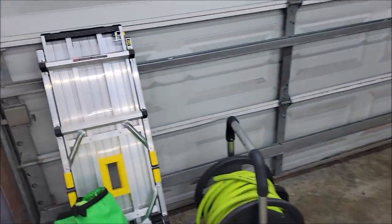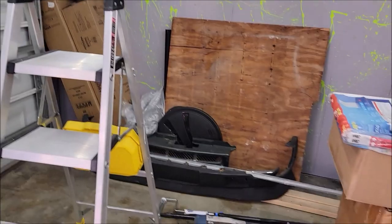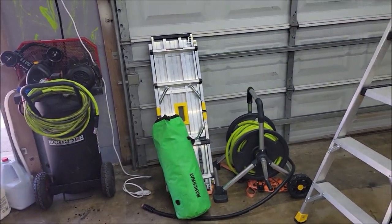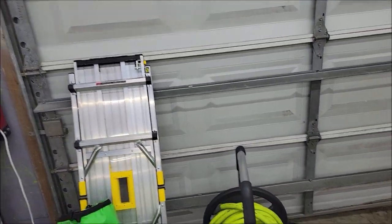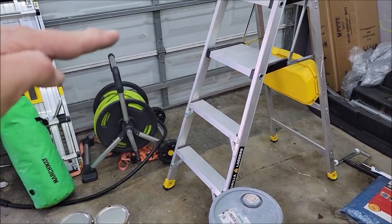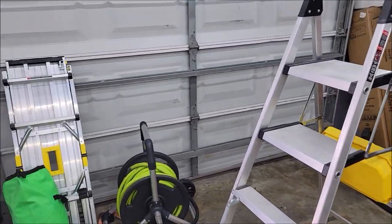It worked great to remove all of the overspray and fumes. But I wanted to take it a step further and have excellent ventilation, so I doubled the amount of fans and built an enclosure. What I wanted was to be able to store a contraption out of the way — slim, very functional. You want the suction to come out and be as great as possible to remove all of the overspray and fumes in the air.